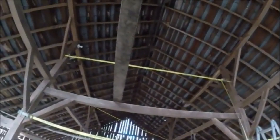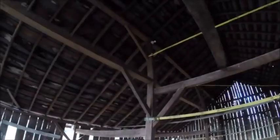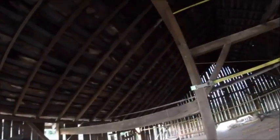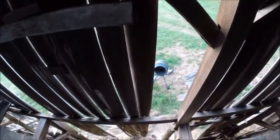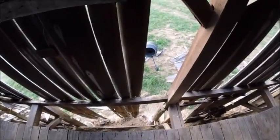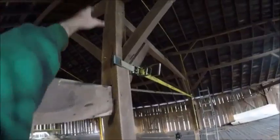But again, the crane is 15 ton. It's going to be a lot heavier, a lot more strength than what these 6x6s are. So it's going to be sitting on 8x8, 35 pound per foot H beams, 20 foot to the ceiling. And initially I was kind of wanting to go clear to the walls, but if I go out here, my hook height is pretty limited to where the concrete would sit in here. It's deceiving there looking down at those posts, but actually the concrete to sit level would be close to the tops of those posts. So I couldn't get but probably maybe a 12, I doubt I could even get 12 feet if I came clear to these walls. It'd be close, I guess, because that's about how much it is under that post over the top of these. So you'd lose that much height out of it.